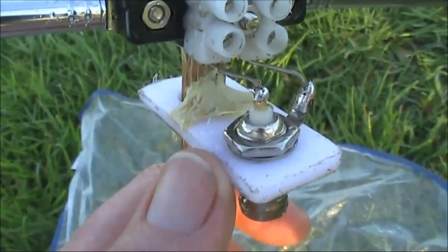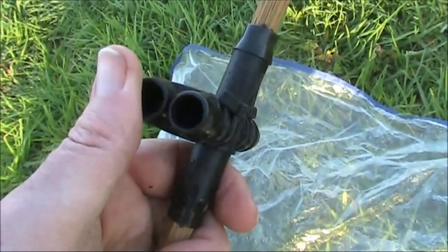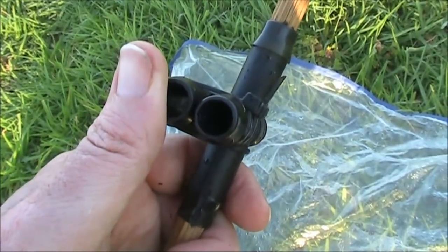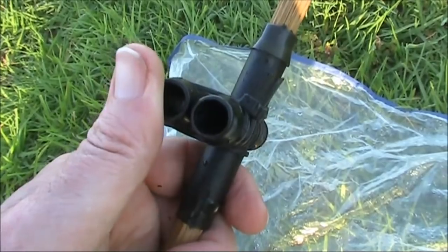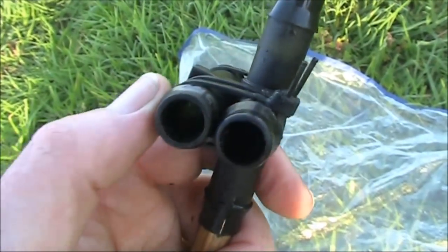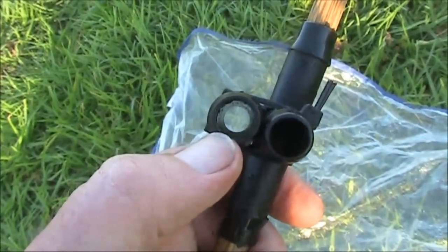A piece of chopping board mounts the antenna socket to the boom. Irrigation fittings are a snug fit to the dowel, which means you could turn it around 90 degrees to make the antenna either vertically polarized or horizontal, as we'll be using here. I've used cable ties to connect another irrigation fitting to it — that's for the mast to pass through.